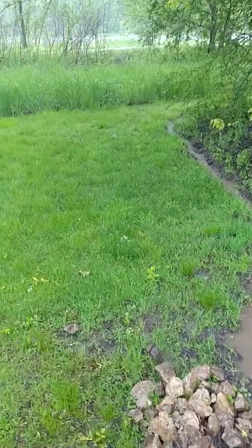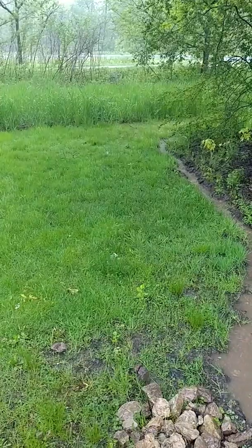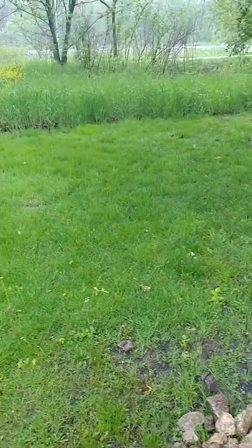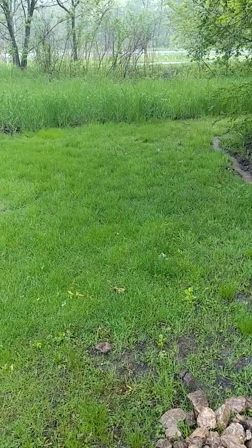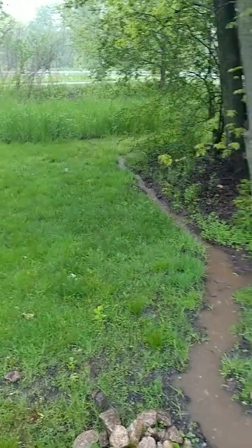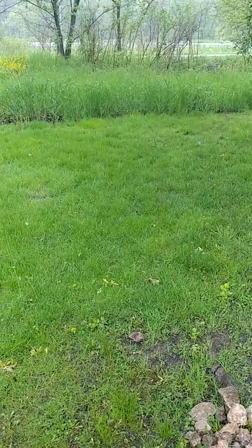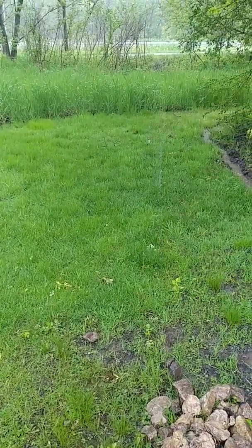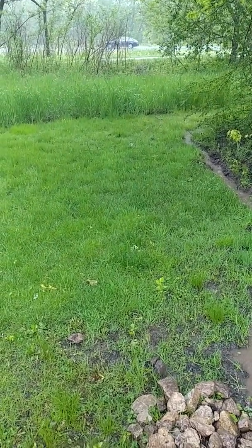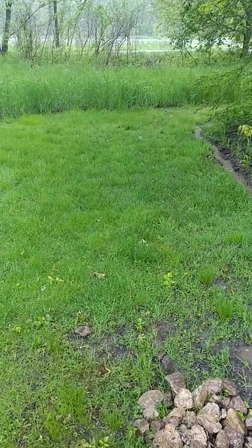As far as ejecting the water, I think I'm going to run a pipe over that marsh area and just have it as a pop-up. To keep it from freezing in the winter, I just don't want to go five feet deep the whole way — I don't feel comfortable doing that with my skill and time. I'm just going to slope it, and I'm not going to put a check valve on. When it pumps out, it's going to flow back into the pit — I've calculated how much the pipe holds and it should be fine. I'll just use a float valve, so when it goes on it pumps out a lot of water.